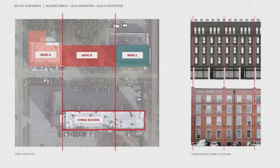I don't know if it's meant to be in direct alignment or not, but your ground floor columns are kind of shifted off there. And I'm trying to figure out, is that due to the parking dimensions on the backside? Correct. So that kind of drives that. You offset those a little bit on purpose? Yeah, there's multiple things that we have to contend with. Obviously, parking is a big one at the rear of the building, and so we really have to find the best place for those columns. We're really restricted here, not only with the dimensions between the columns, but also how many parking spaces we can fit within them, and so on and so forth.